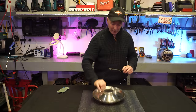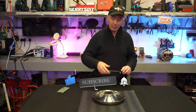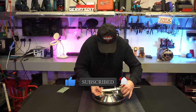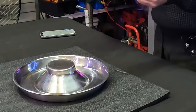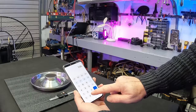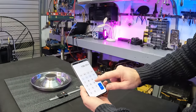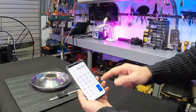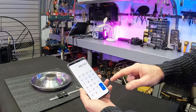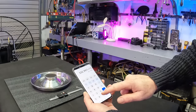I put a score line all the way around near the top of this, and I want to measure the diameter because we want 15 holes spaced equally all the way around. We've got 106.05mm — multiply that by pi, so 3.14, and that equals 332.997. Divide that by the number of holes we want, so divided by 15.